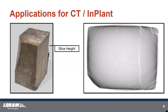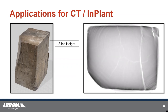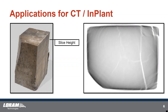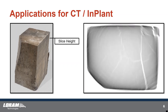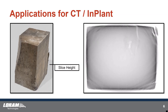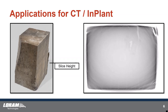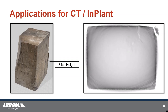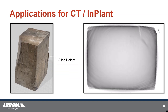Some of the things you'll see: we have the wane down here on the bottom left — as we move down, that wane is going to go away as it closes up at the corner. When it resets to the top, you can see this cracking pattern, which goes away as it moves towards the inside of the tie. You can see this finger in the top right corner — as it gets about halfway down, you're going to see it's a little finger of wood that splices off, and then it comes back together with the air gap under it. So 3D reconstruction can display as a video, and we can data mine all of them — they're just two-dimensional cross sections — and analyze them as 2D cross sections or as a full 3D reconstruction.